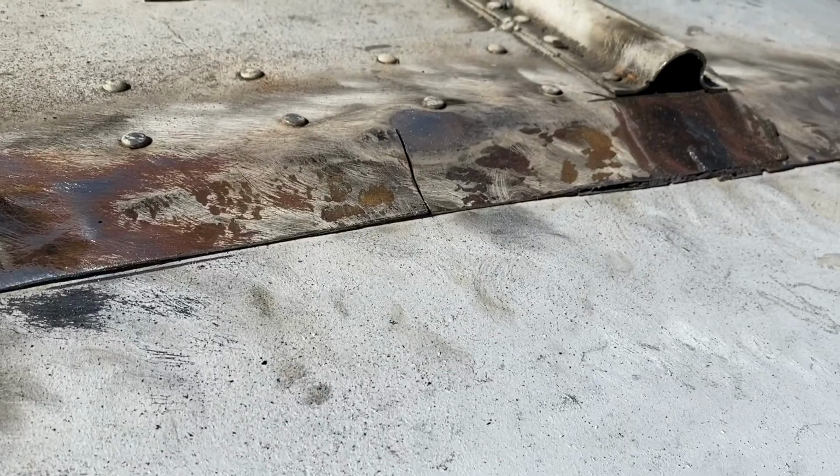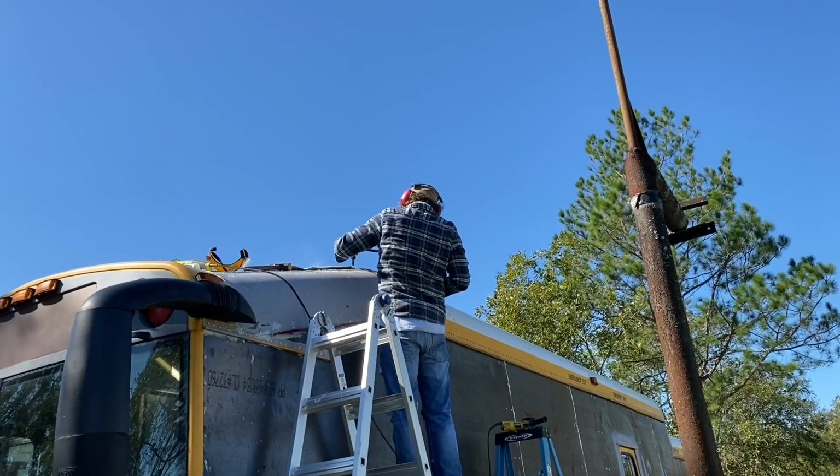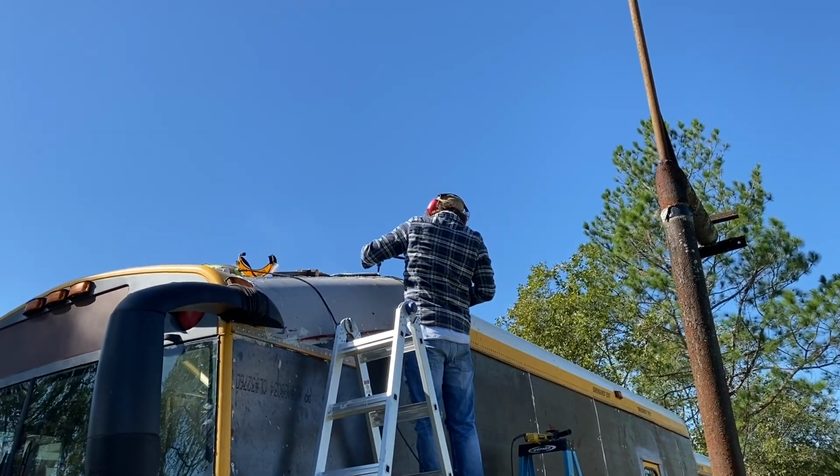And so fortunately we had our floor jack still in the floor of the bus that we had used for the roof raise, and so we kept it, and we had a post, and once it was secure on the front end of the bus right behind the nose cone, we had to make sure that we had it pushed out to the hat channel at the top of the transition, so we were able to get the floor jack and a fence post, and we jacked it up and got it in place there. And then from there we went back and riveted all of our holes all the way up to the top, and our front transition is amazing because of it.